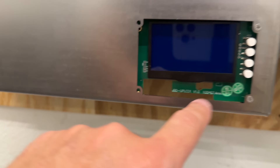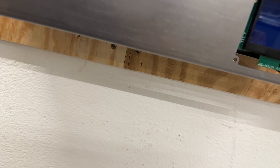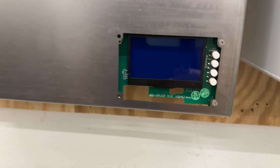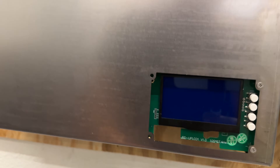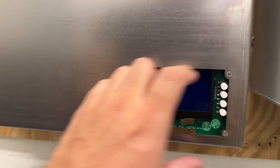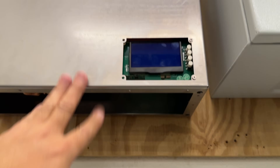I got this wrong — these holes don't even match. I thought I had it right when I checked the front face, but they're off. I'll have to measure exactly how far off the screw holes are and adjust that, then redo the overlay with the PCB. Anyway, that's a simple fix.